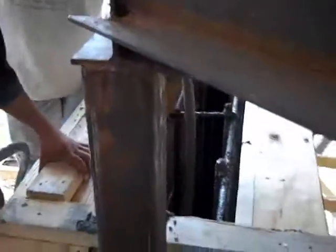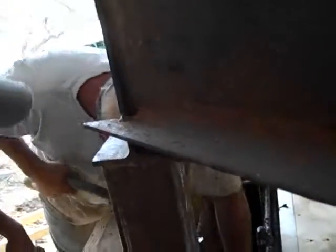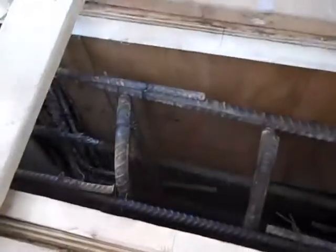That's my lead foreman Michael down there with the vibrator. This is a 20-foot tail on this vibrator. It's real important to vibrate your concrete to get all that air out of there and make sure we've got that 3,000 psi concrete throughout the entire mix. We've got good spacing between the concrete and the rebar, and you can see we've got some seriously beefy rebar down inside of this tall wall in here.